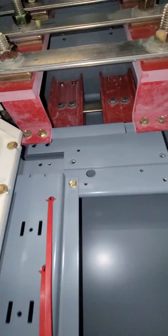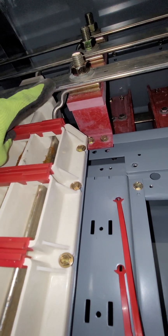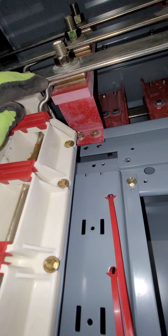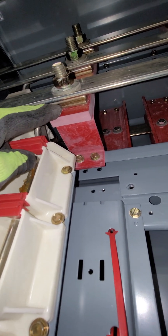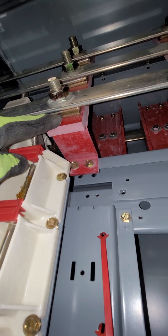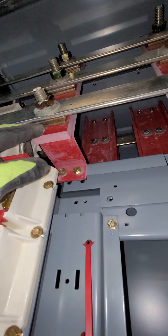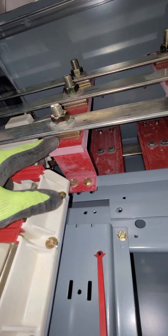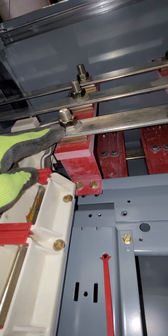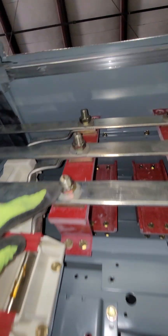The vertical bars are mated directly to the horizontal. There is a little gold metal plate spacer that actually acts as a threaded nut. The bolt comes through the back, through the insulation, and threads into the copper plate which holds the bolt captive. Then when you're all said and done, the lock washer and the nut go on top and those are tightened.